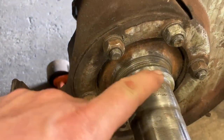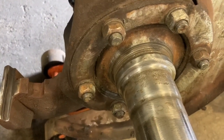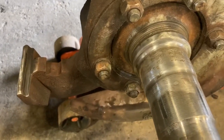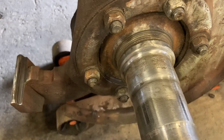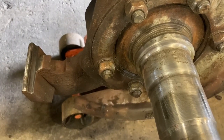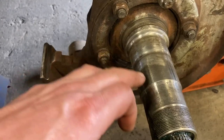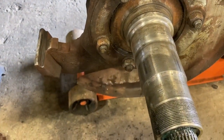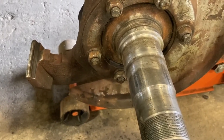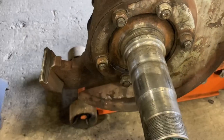I've pulled and repacked the bearings before. I usually put some never-seize and make sure you get this all sealed up with grease. Maybe spray some fluid film or something on it because you can see how bad the rust gets. I've already gone over this with emery cloth and cleaned it up with Scotch-Brite. The seal surface isn't in very good shape so it's going to continue to leak a little bit. You always want to make sure your seal is packed with grease really good. Put some fluid film in there, but it's tough with the way it's out in the cold and then goes into the Zamboni room where it's warm — it draws in moisture and condensation.